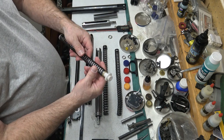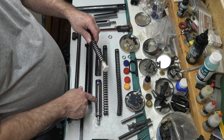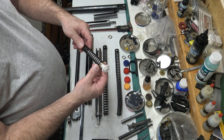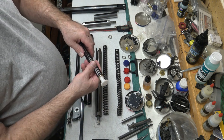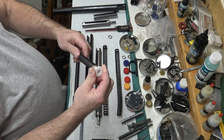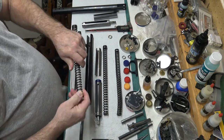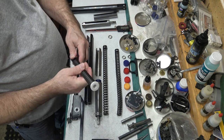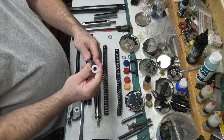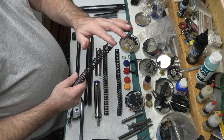I made a little piece of brass for the bearing washer on this gun - it needs to be smaller than the outside diameter of the spring so you have total clearance when the piston engages the trigger sear. I went with brass to give it a little bling since it's an iconic R10. The top hat hole should be a slip fit but tight on the spring so it can't come off.